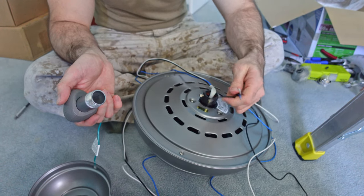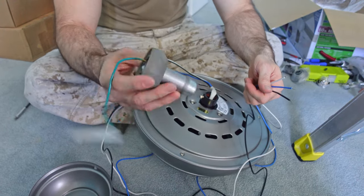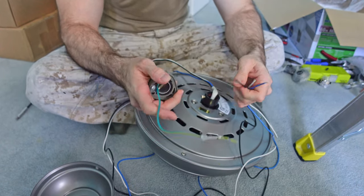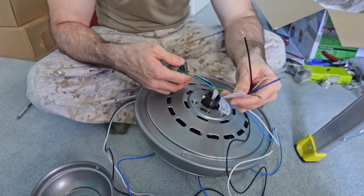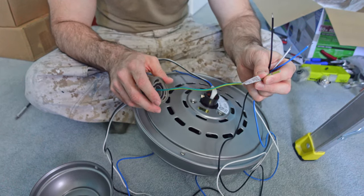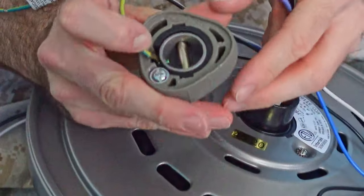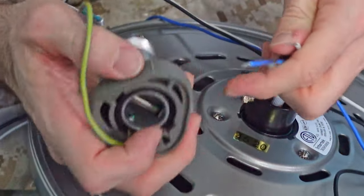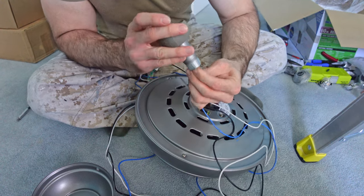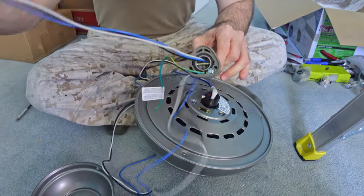My fan comes with several feet of cord. I do not need all of it because this is meant to go up through a very long hanging rod. Since mine is going to be mounted more or less flush to the ceiling, I only need a few inches. I'm going to run the cables through here and cut them off so they match the length of the ground cable. Looking on the inside, there's a pin that splits it in half — I just want to run these through so they're all on one side of that, then pull them all through.